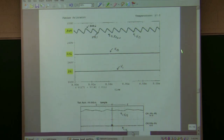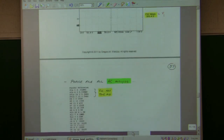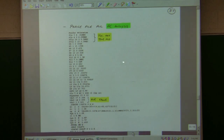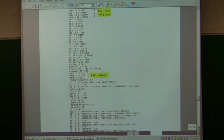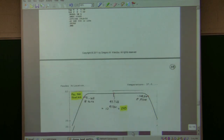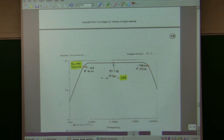I took these voltages in the simulation and then hooked them up. And then ran the simulation a couple times. I originally set the volume control to max and tone control to mid, and then I replaced the stuff that was there for the power supply with the average value of those 3 nodes coming into the circuit. Then you can sketch magnitude, angle versus frequency. And so this was the one with the volume maximum and tone in the mid position.